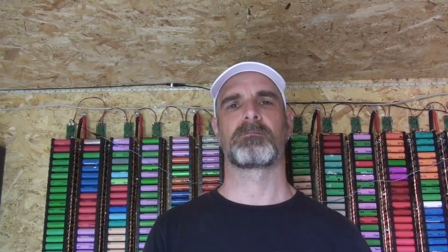Those of you who've watched my monthly stats videos may have heard me mention that I can't get my self-usage above about 95%, because I'm always pulling a small amount of energy from the grid even when technically running fully off batteries. Why is that? Let's look at exactly why you get this small bleed of energy from the grid - and also from your home out onto the grid. Assume the battery inverter takes a reading from the CT clamp every second - it's actually faster than this, but for the sake of example let's say every second - and that it takes one tenth of a second to react to that reading.